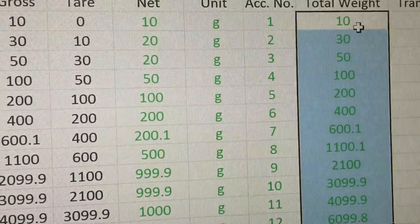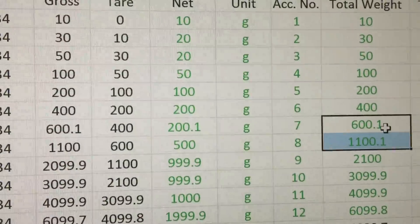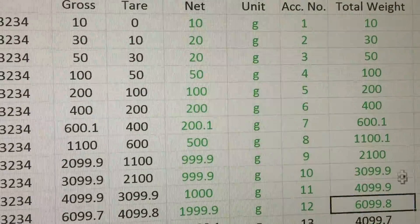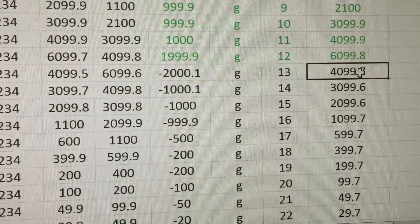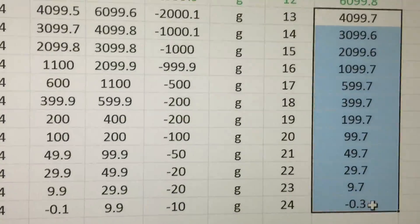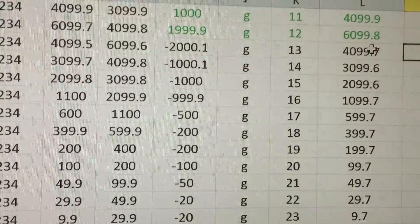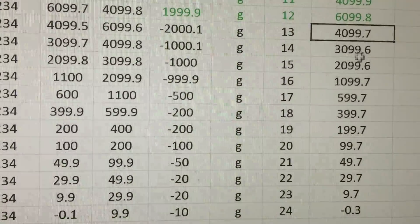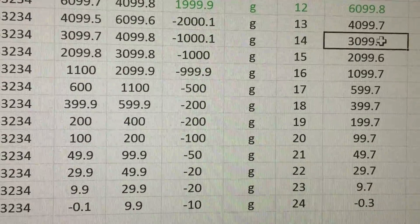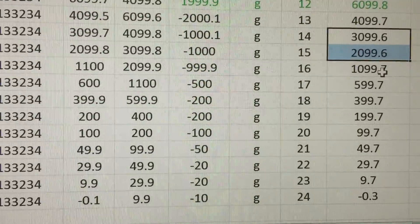Now take a look at the results. The green numbers are the data of the loading process — we can see here we have plus 1d error and then here we have minus 1d error, and the maximum is minus 2d error. The black numbers are the data of the unloading process. The remaining value here is minus 3d. To calculate the corrected error, we take the number and then minus the remaining value — in this case this is perfect. We have minus 1d for these two transactions and all the way down is perfect, meaning no error.